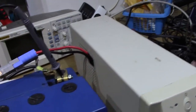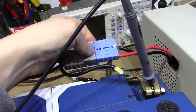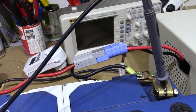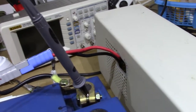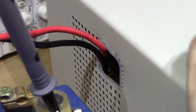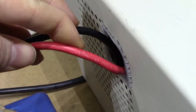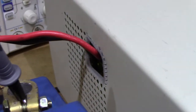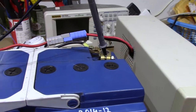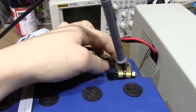After some time I upgraded the hole when I installed a non-12V Anderson connector with some pieces filed away to make it fit. I'm not sure if it's a 12 or 24V Anderson, but I pushed the connector through the hole. Up until last night there was no strain relief — just sharp metal edges for many years, so I added a plastic piece last night during maintenance. Thankfully it hasn't shorted out yet, which is good since the fuse is internal on the PCB, so a short on the cable would just spark until the battery is empty or something catches fire.